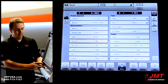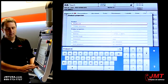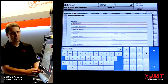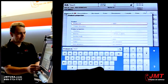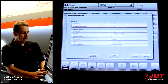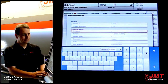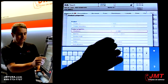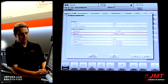To draw in a new program, I simply come over to our Products key and go to New Product. I give it a product ID — this helps us when searching for products later, as we have a very populated library. Let's call it Test. I give it a product description, then assign a material thickness — whatever you're bending, whether it be eighth inch, 16 gauge, or what not. From there I assign a material type, and I also have the ability to assign custom materials. I'm going to use mild steel for this instance.